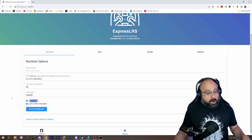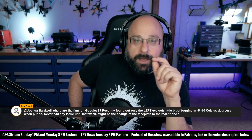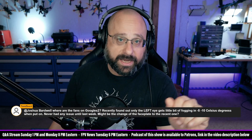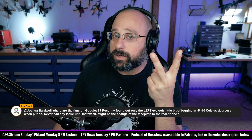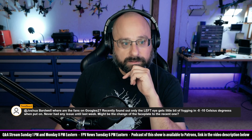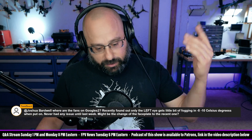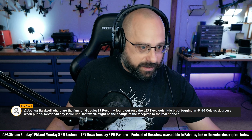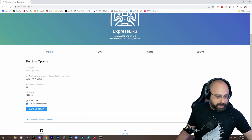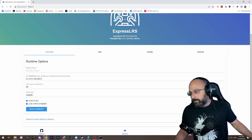Blunty, this is huge. People want to be able to connect a GPS, an ExpressLRS receiver, and a digital VTX on that build, and they can't do it because there's only two UARTs. This would give them a third full UART. I've got to make this video. That flight controller only has two full UARTs, so you basically can't do it. But if you're going to connect to an SBUS pad, you have to do the Invert TX Pin. If you do this normally it will stop working — your receiver will stop working — so don't do that.